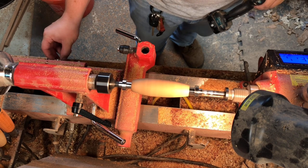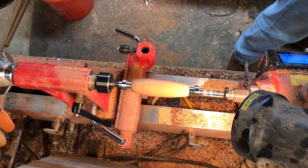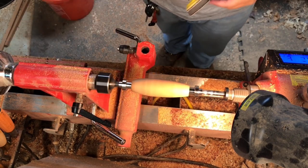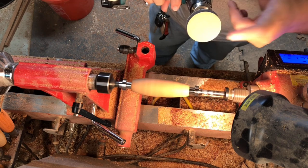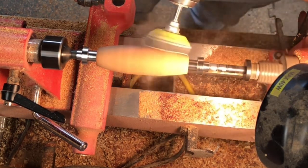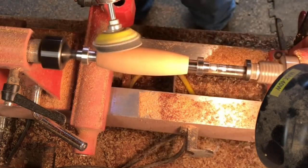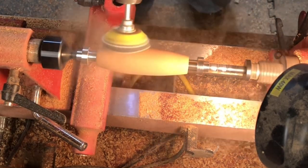Set the lathe to about 2,500 RPM. I have these little 12-volt Makita drills — they are a huge time saver for stuff like this. This is just a $4 kit off Amazon. I will say, buy some good sandpaper; I like the Duragold stuff for this. We're going to start off at high speed and just sand side to side — only light pressure is needed.